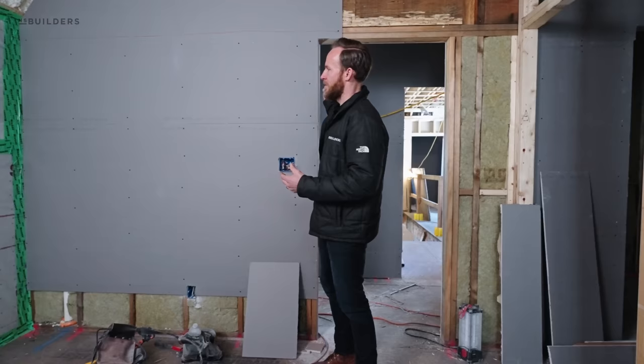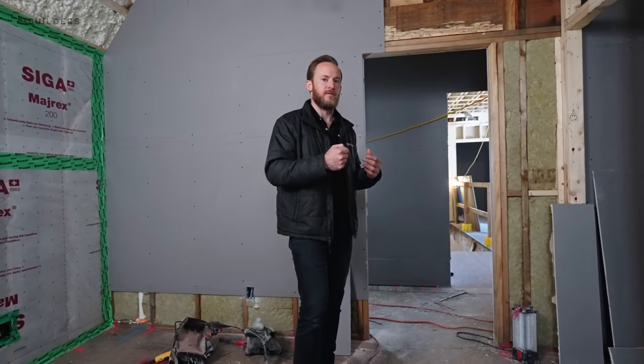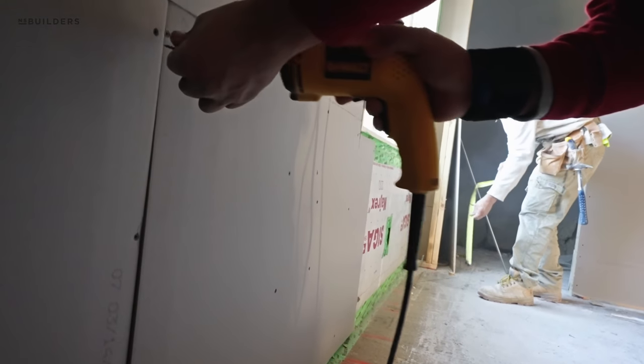Veneer coat meaning that we will screed an entire coat of plaster across the whole wall. They're typically using a 14-inch trowel and burnishing that plaster. It's really beautiful - it's what we do here in Massachusetts in all of our homes. We'll be doing a single coat plaster on this home, so it's not as important to get ultra flatness. That doesn't mean we don't do a good job - our framing has been dialed in. Our team actually went around and checked every stud for plumbness as well as flatness to make sure that the board hangers are prepped for success. If the board's flat and then the guys come behind it with plaster, that plaster is going to be flat. We're still taking all of the same steps to get there, but we're just not doing a true two coat on this project.